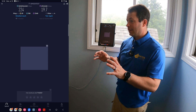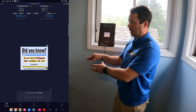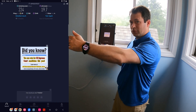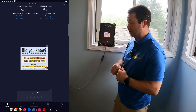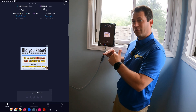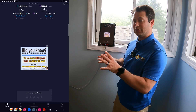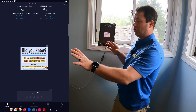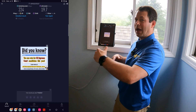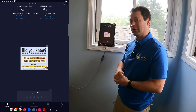Remember that all your results will vary. For me, my gateway is at the same height off the ground as the antenna — just to the side inside the air-conditioned space. If I had the gateway downstairs on the first floor I'd get much worse signal. So this is probably showing about the smallest delta you typically see when adding an external antenna. Now let's hook the ethernet cable up to the Elsys and see how it does.